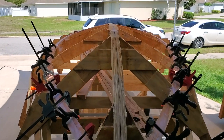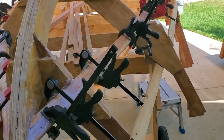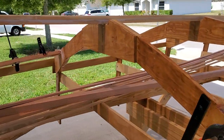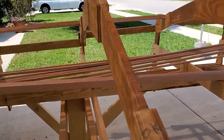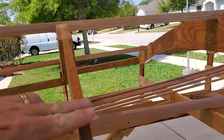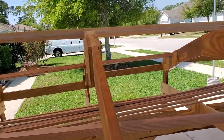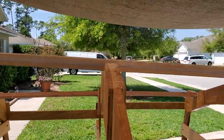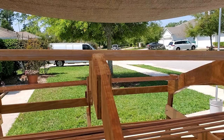You can see I've got a nice center line down the keelson and stem. I think the way I'm going to attack this — as far as getting out my power planer — is start with the keelson from about frame three right here, because this is the flattest, straightest area. I'll get that nice even flow to the keelson. There's a little bit of wood I've got to remove to make a crown point so the plywood, when it sits on there, will have a nice basis.